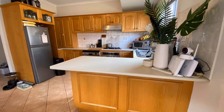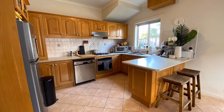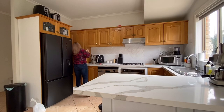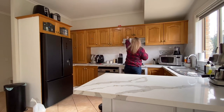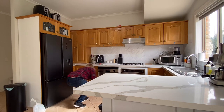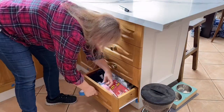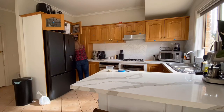Here is my beautiful early 90s kitchen — it's timber but done with a veneer front. You can also do this to laminate kitchen cupboards using an extra primer at the start. We need to label all of the doors. If you don't do this, it's going to take you quite a few hours to figure out what goes where, because they're all slightly different shapes and sizes. Write it on painter's tape so it will easily come off. And don't forget to do your drawers — it's really funny if you get them wrong.